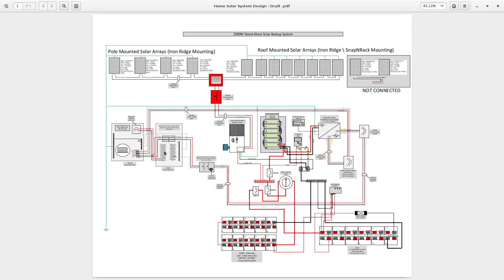The last branch is connected to a back-feed breaker with an interlock kit, so I can either be connected to the utility or I can back-feed safely and energize two branches in my main circuit panel.